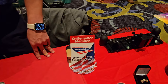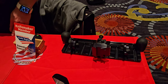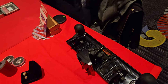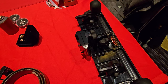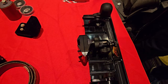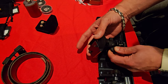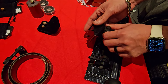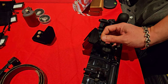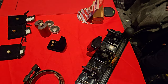Did you also want to mention the sharpening system we were talking about earlier? Yeah, let's definitely put that in there. I'm partial to my arm. The fixture piece — once you get your angle down, it picks up, flips around, and you can get the exact replication of the same angle on the opposite side. Once you have your blade clamped in here, you set the angle for the bevel that you need. You grind one side to where you want it, and it's dovetailed here, so it flips around super easily and accurately and you have all your angles set for the next side. It's genius — I love the fixturing.